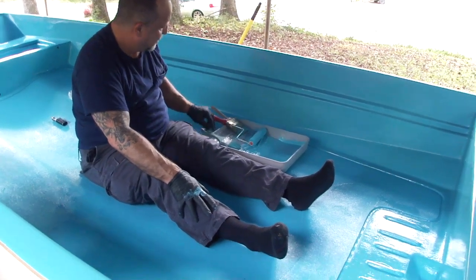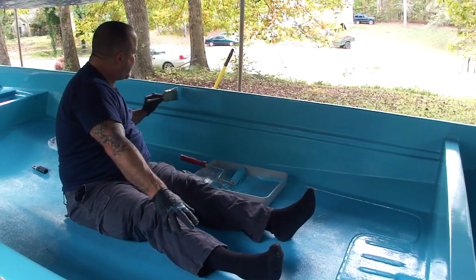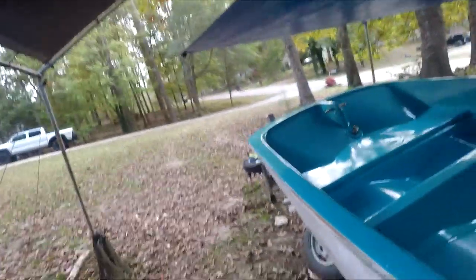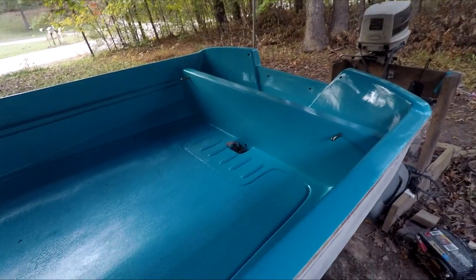I think we might have overkilled it a little bit. I'm just amazed that this tipping technique works as well as it does. There's been a lot more to the painting than what's shown, but I didn't want to put 30 minutes of rolling and tipping on a video. I hope you've gotten something out of this. I'm really pleased that we've got this topside finished. I'm going to be turning the boat upside down and getting ready to do the hull — we'll do some of the work in the winter but most of it in the spring when the temperature warms up again. It's getting a little cool now; evenings are in the 40s, so definitely can't put any more paint on. If you've enjoyed this video, hit like, share, and don't forget to subscribe. Thanks for watching.